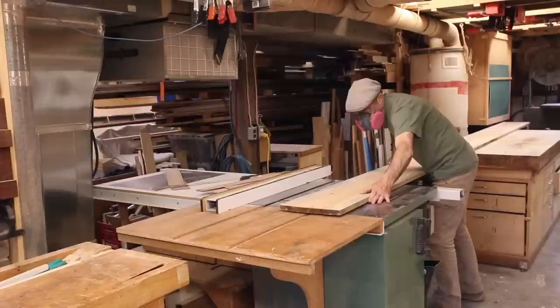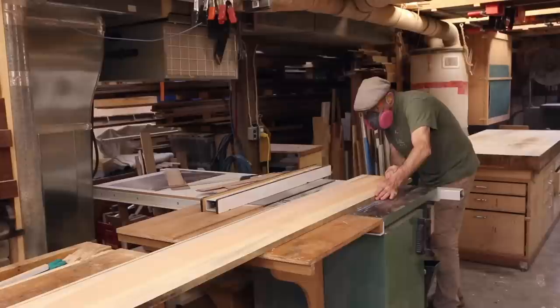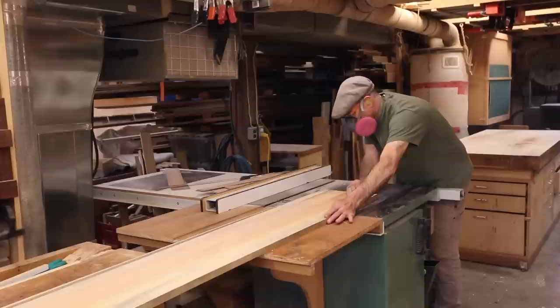If I have to cut near the center of a plank, say if I'm cutting out a plank shape, I will only do that when I'm using something that's very stable, like vertical grain red cedar, when the planking is on the thinner side, say about 1/2 inch. I'm always worried about binding and kickback, of course, so you need to be careful that you're not attempting this in situations where that is a higher risk.